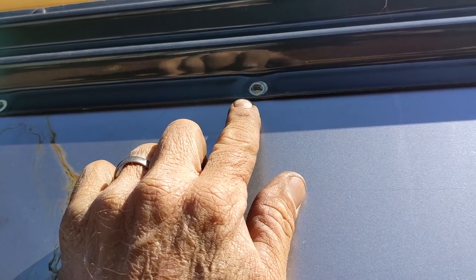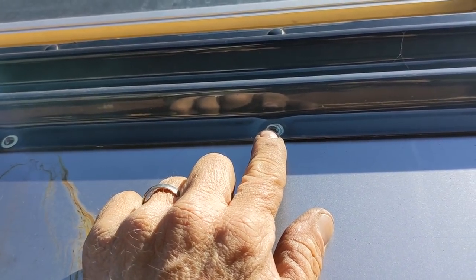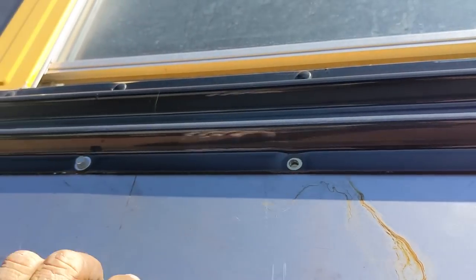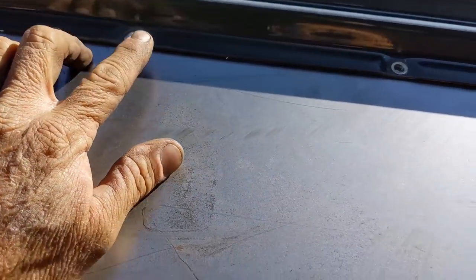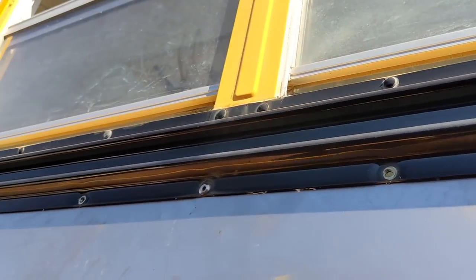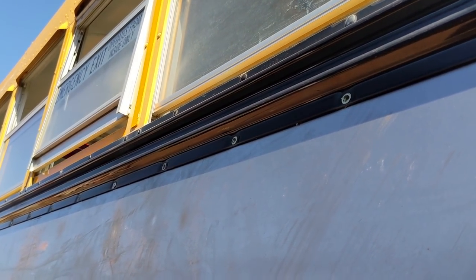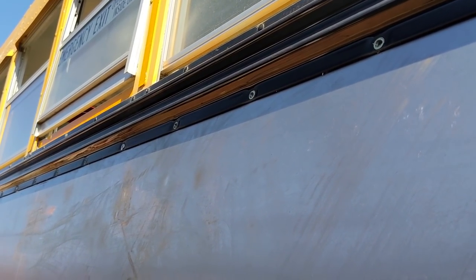And we use quarter-inch rivets because they are just slightly larger than the factory big rivet holes. And that way, when we drill them out, it makes a nice tight seal in there. And I'll throw a rivet in wherever there's a rib, because those don't get the washers on the back. Then I'll pull the screws out, then I'll put the rivets through the holes, put washers on the back, and the sheet metal panel overlap, and then those get riveted in, and that's done.